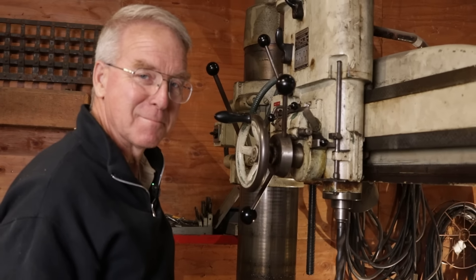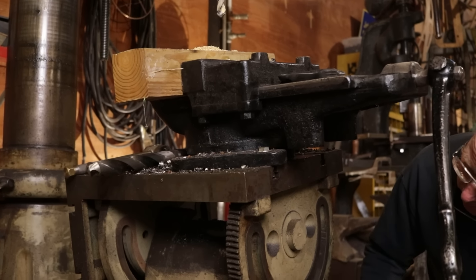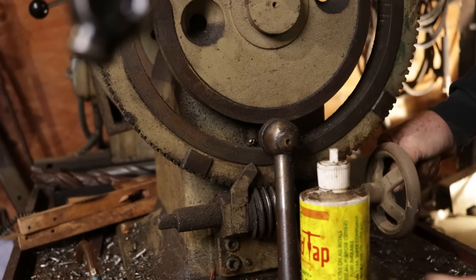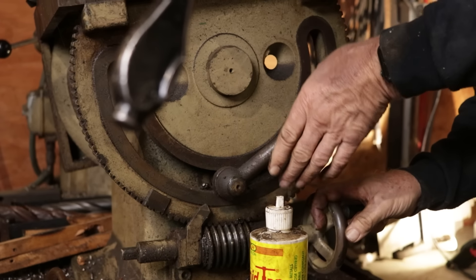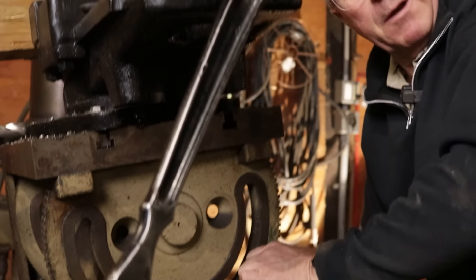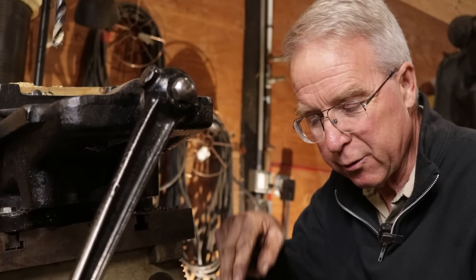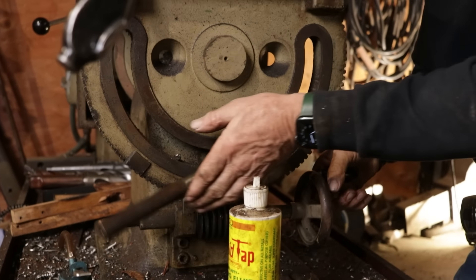I mentioned that this knee is adjustable — it's really nice. You just loosen that, which is the clamp, and then it's got a worm so you can rack this thing around either direction. And it is nicely indicated right here. We're coming up on 10 degrees right there. Now that's handy — a drill bit doesn't like to drill in at an angle, but if you put an end mill on there, this thing will chuck up, will present an end mill so you can drill an angled hole in a piece of steel. I've used that four or five different jobs. And each time I think, thank you Kelly for finding me exactly the right radial drill for this little shop. Back to 90.